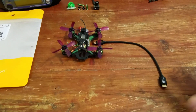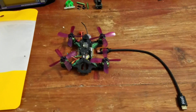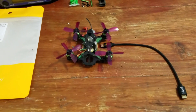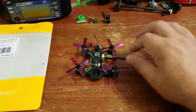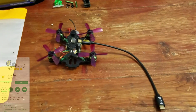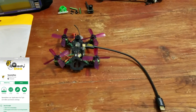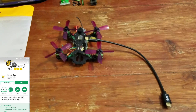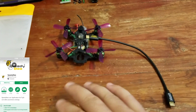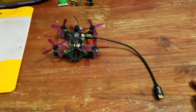You can just use your Android phone to adjust Betaflight in the field. It's actually very simple and is almost as good as the actual PC version. Let me bring up a screen recorder and I'll show you guys how this works. To get started, I'm going to plug this cable directly into the quad, then open up the SpeedyB app — you'll see a picture in the left-hand corner — and then plug the other end into my phone.